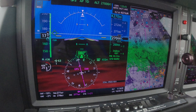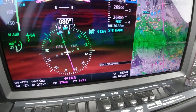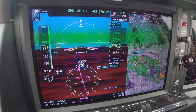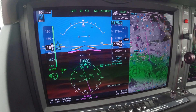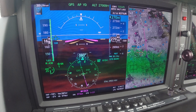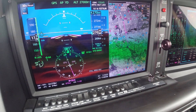Now the system's dwelling for 42 seconds. When you turn on the Wing Stab IPS, you'll get this CAST message that says 'Stall Speed High.' It's to remind the pilot that you turned on the pneumatic boots in icing conditions because obviously there was ice on the aircraft. Any time there's ice on the aircraft, you want to be at least 160 knots of indicated airspeed. And if you want to conduct a landing with ice on the aircraft, the maximum flaps configuration is 50% of flaps — you're not supposed to land with full flaps if you have ice on the aircraft.